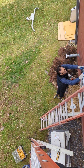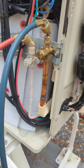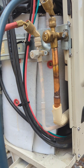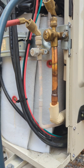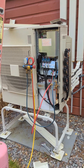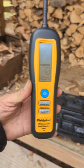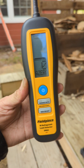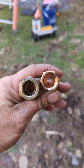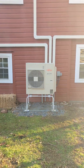This is how you know there's a leak in the system: your pressure goes low, the high side in the heat pump becomes the low side, and it's icing up. That's how you know you have a leak. This leak detector is a hundred percent recommended by me — please subscribe and share. This is TJ HVAC, and we got it all fixed. Thanks for watching!